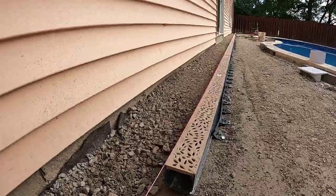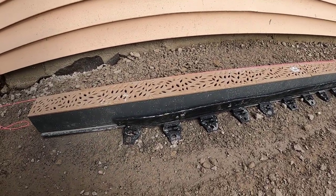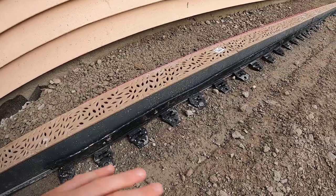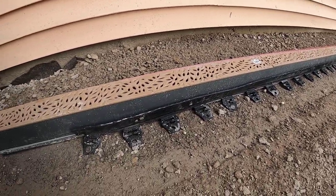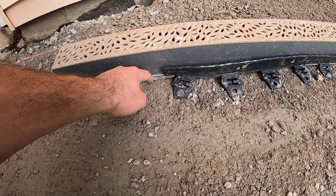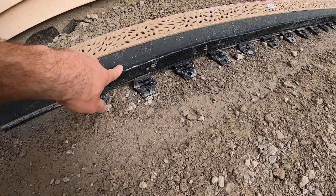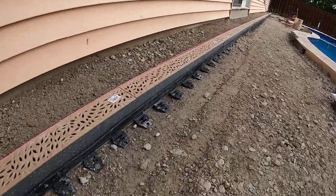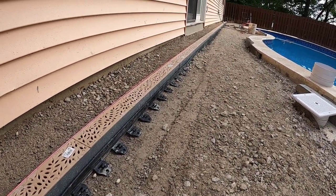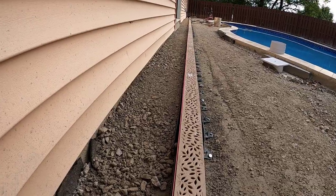This is a paver edging product — I'm going to use it on the outside of my travertine pavers around the pool. I had some rolls sitting here and was thinking of the best way to keep the channel drains secured as I add and compact gravel on both sides. There's a little lip on the bottom of the channel drain, and NDS makes a specific plastic stake for securing these — but instead I chose to use the edge restraints. I ran them the length of the channel drains, resting on that lip, and staked them every so often on both sides. It held in place well.